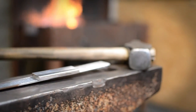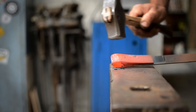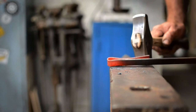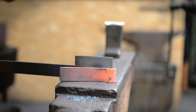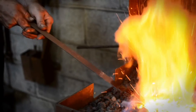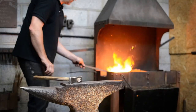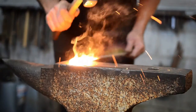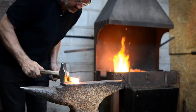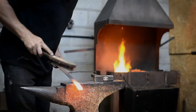Fire welding is the pinnacle of the blacksmith's art and the most complex technique to master. It involves joining two pieces of metal using the extreme heat of the forge and, while still in a plastic state at around 1200 degrees C, hammering them together. There are many different types of join and different steels weld at different temperatures, which presents complexities for the smith when it comes to fusing high carbon and low carbon steels. Laminate steels, damascus steels, and sharp edge tools are all made using fire welding, and a great deal of practice and preparation is needed to perfect the technique.